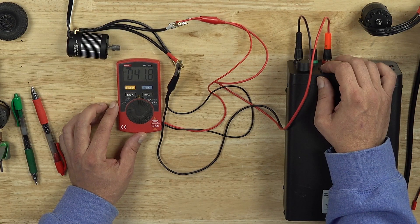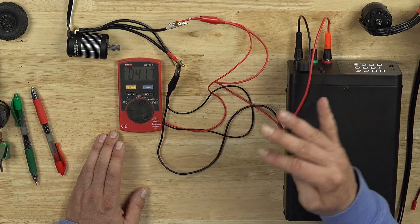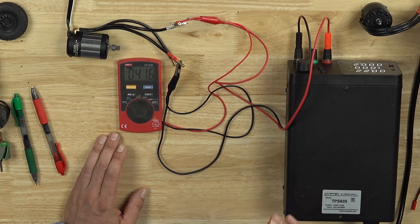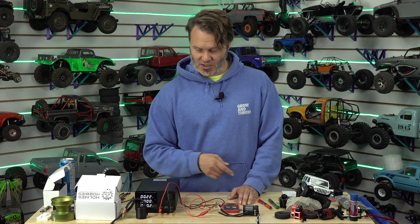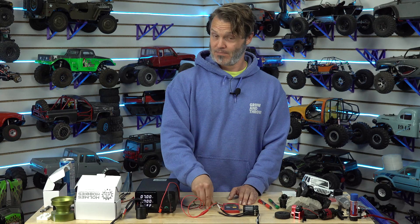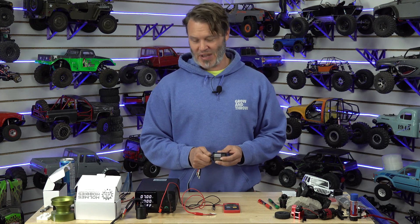This one is actually the same resistance through the wires. Interesting. Both of these are the same stators, and if you go from four-pole to 10-pole you would typically have a lower resistance, but it's kind of dark magic in a lot of ways. Very surprisingly, this actually does not have any lower resistance.